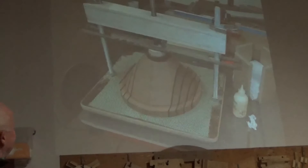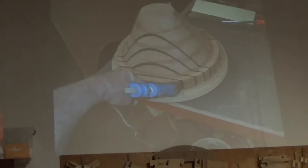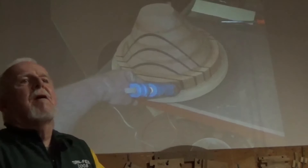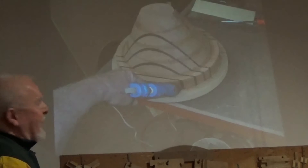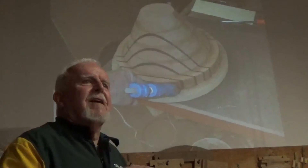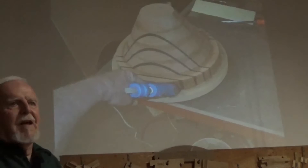There I am putting hot melt glue around the outside edge before I put it on my lathe — just around the outside edge in about eight places. I have an MDF face plate with a real scroll chuck face plate on the back of the MDF. I've probably made half a dozen bowls or more out of each MDF plate. The glue holds but comes off when you want it to. The kitchen sink cutout material all has a slight bow to it — great for other things, but for this I needed dead flat, and MDF is dead flat.